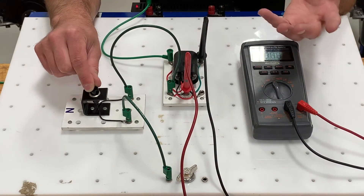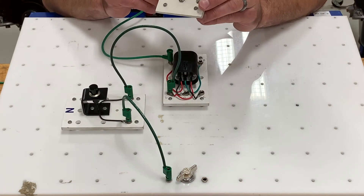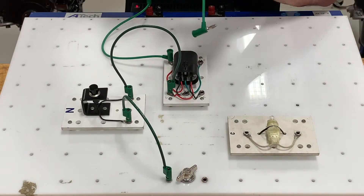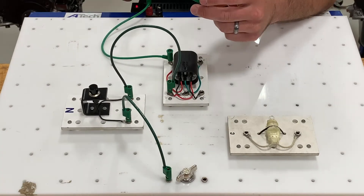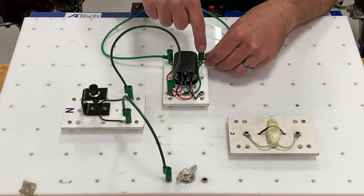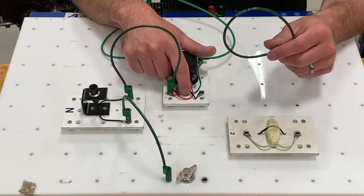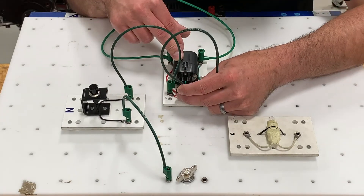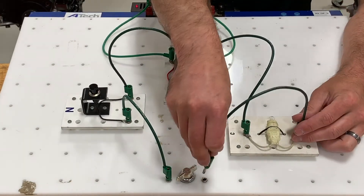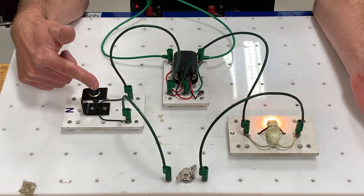This helps me understand what to do next. If I want to complete this circuit to control something, we're going to take this small 194 light bulb and set it up so that my relay controls it. I need to take 12 volts and provide it to the action side, so I've got to take another connection of 12 volts here at the top going to pin E. Pin A, the center pin, is where my normally open position was, so I'm going to make a connection there, go to my light bulb, and go to ground. We get all this set up, we push the button, we get a light bulb.